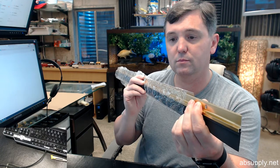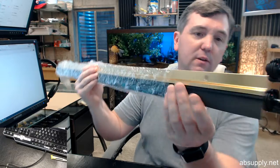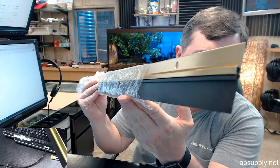The 307 is going to be available in the A finish for mill aluminum, bright dip gold (BDG, which is this one), C for clear anodized, D for dark bronze, G for gold rather than bright dip gold — it's a more matte or flat gold color. This might complement polished brass a little bit better because it's shinier, a bit more metallic. You'll also be able to get this in painted white (PW), literally a powder coated white, and SN for satin nickel. So every finish really possible from Pemko you'll be able to source this unit in.